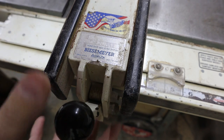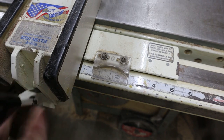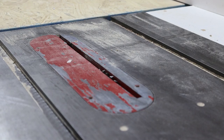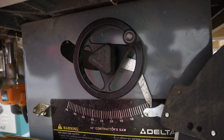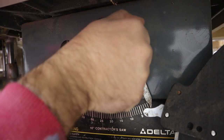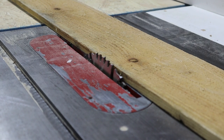If you're new here, please consider subscribing because we do build videos just like this one to help bring your hobbyist woodworking to the next level. We're gonna go ahead and set our saw to an inch and a half and we are going to rip down two of our three fence pickets.